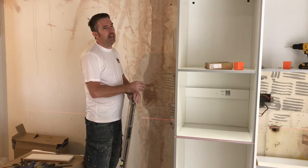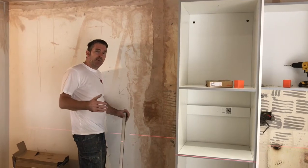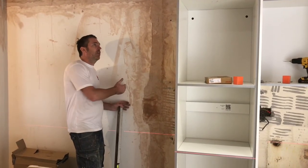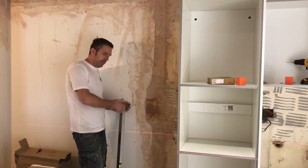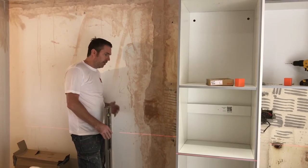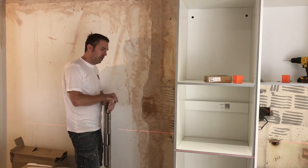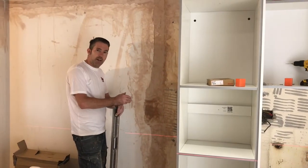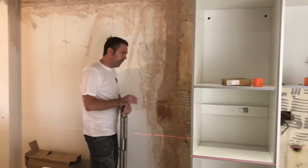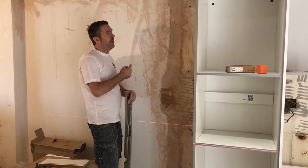That'll be at the end of the day, because there's some curved panels on this. But with it being a curved panel, as panels are oversized, they will go back to the wall, and we'll scribe it into the wall, and we won't notice that dip. Do you know what I mean? The other option was to knock it all off and reboard it, but the customer didn't want to go to that extent and that expense. So you can only work with what you can work with, and that's what we're working with. But by the time I finish, you'll never know it's a different level.